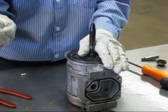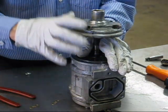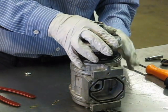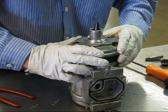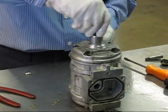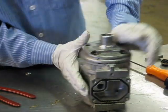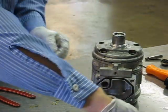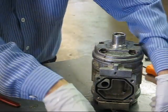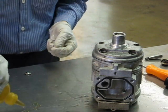At that point, we take the cylinder head in one hand — I put my hand down here just in case it drops fast so it doesn't pinch on anything — and very slowly work that cylinder head down over the protector tool and down on the shaft. Your shaft seal protector will then slide off and the whole thing is together. Make sure we have all our brass crush washers removed from our cylinder head bolts and we use new crush washers, adding plenty of mineral oil.